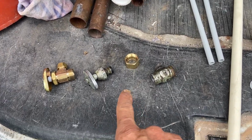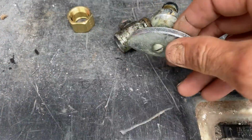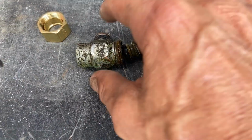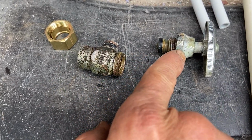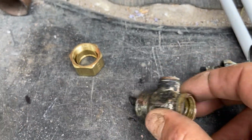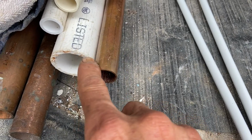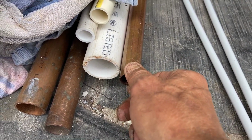All right, so if you saw after I turned the water off, I unscrewed the handle out of the old valve. That way when I heated this thing up, there was no water that's going to catch on that thing, and we could just slide that thing off. Second of all, we cleaned all the old solder off and sanded it real well so there was no voids left in there.